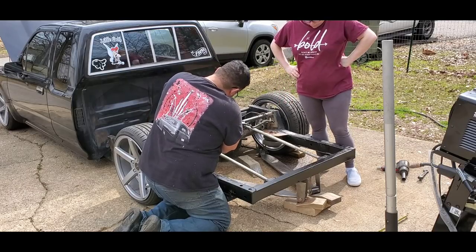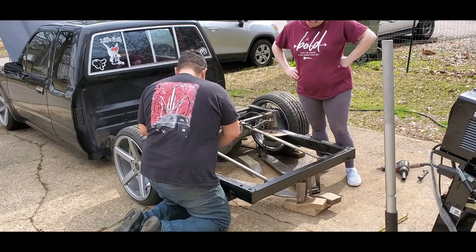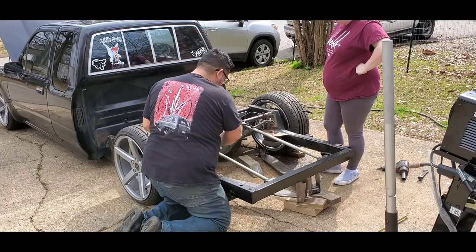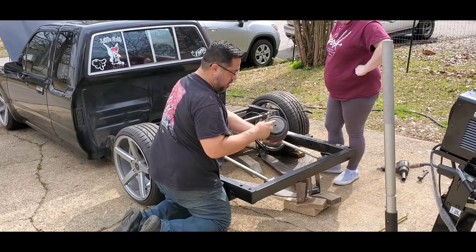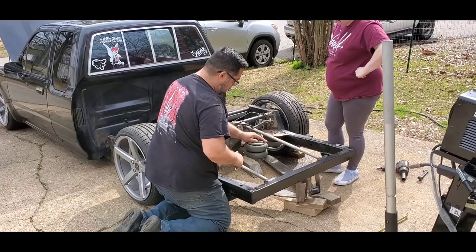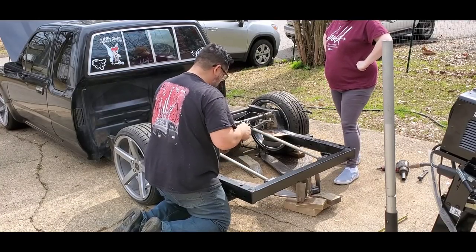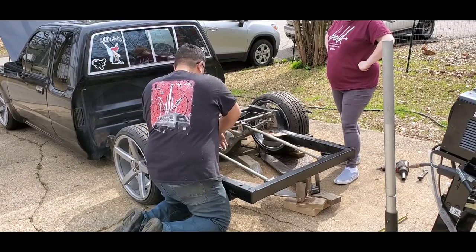Okay. This is why we have not reinforced the bags just yet, or reinforced those bottom link bars, because where the center hole is on this, that's going to be the mounting point. We need to put the lower link bars on, center them up with that so we know exactly where the hole is going to go on these before we start making our reinforcements.